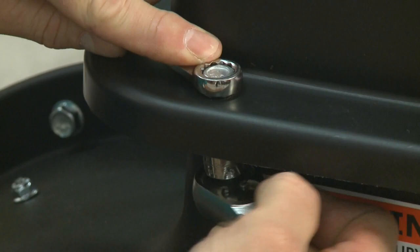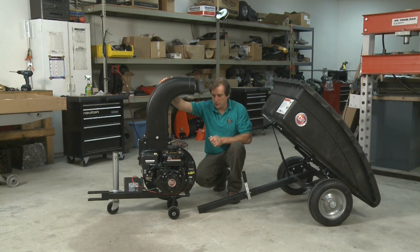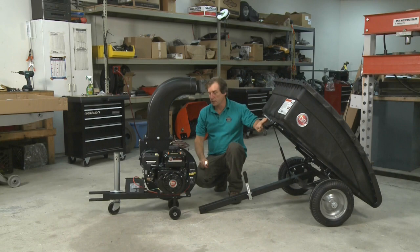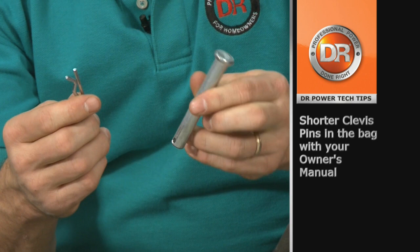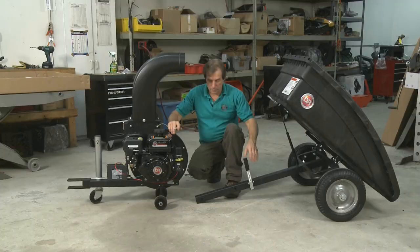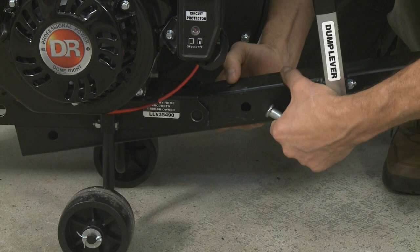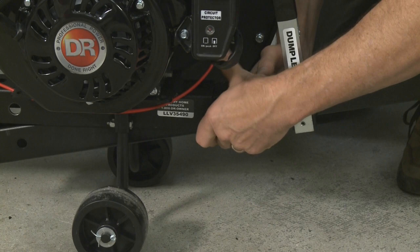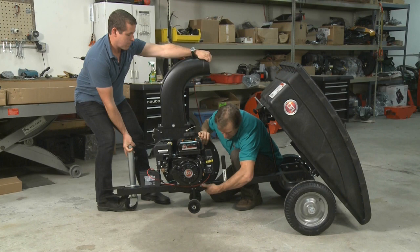At this point we wheeled the power unit in place. Cart next to it — make sure that your cart bed is tilted up and that the jack is in its lowest position. In the product package, there is a small bag with some hardware. Pull out the two shorter clevis pins with the clips, which you'll use to assemble the unit together. Slide the cart until you align the holes, insert the pin as far as it will go, and then have your helper lift up on the chute to better align the holes. Secure it with the clip.